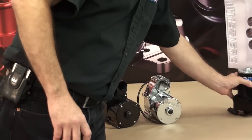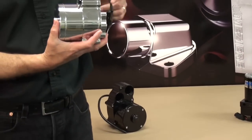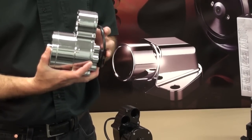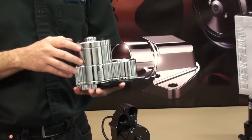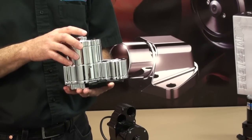In the case of the 35 or 55 GPM pumps, the pump shaft is typically horizontal with the ground. If you need to mount the pump the other way so that the shaft is vertical, only make sure that it's pointed up. You can't have the pump shaft pointed at the ground — the outlet must be up so it will purge air properly.